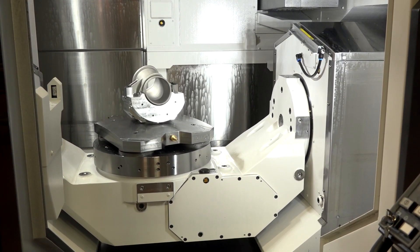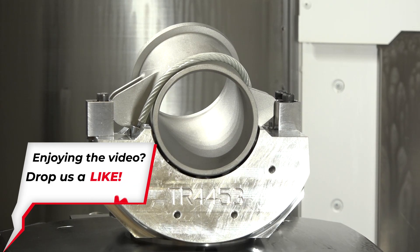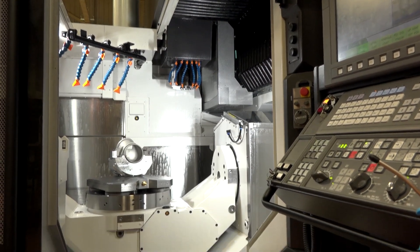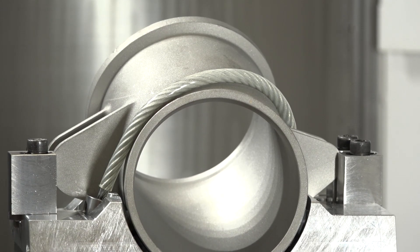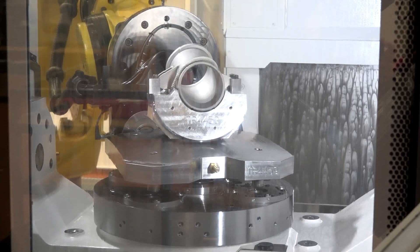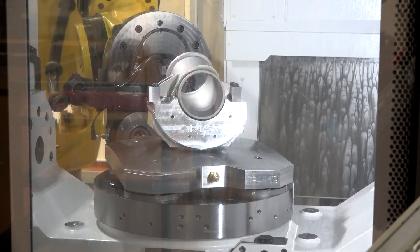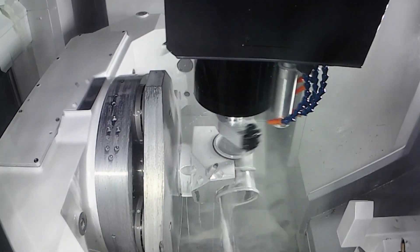Is Turncut available with some of the other machines that Okuma supply? Yes, certainly. It was originally developed with the horizontal machine, so if you're putting a large valve on a horizontal you can get all the way around it on the B-axis — you can do boring and profile bores of port forms. Then it was developed on the Multus mill-turn toolchange lathe, launched at MACH in 2016, and more recently on the MU series 5-axis machine, developed around 2018, which is what we've put on this machine.